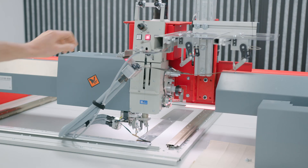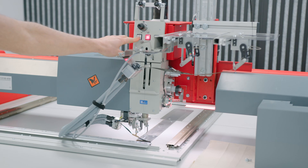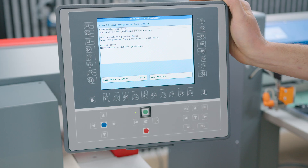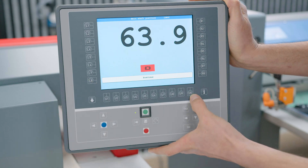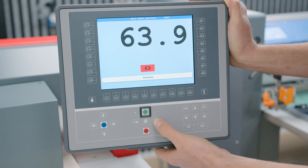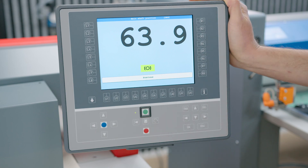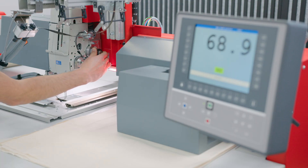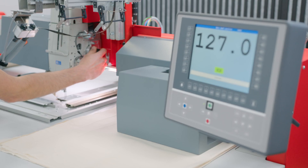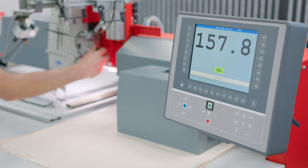Press the left side button on the W head to bring the presser foot down. Press L8 for main shaft position and disengage the brakes with the jogging button. Rotate the main shaft counterclockwise until it reaches 180 degrees.